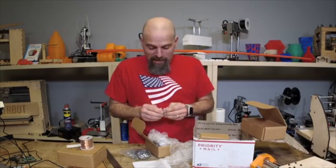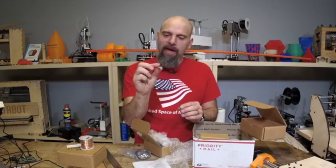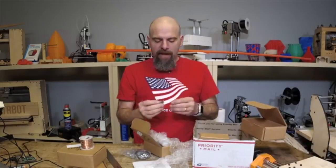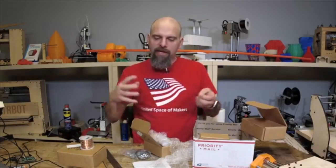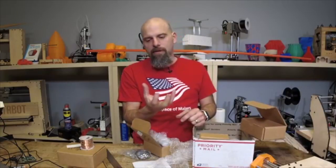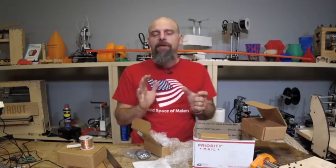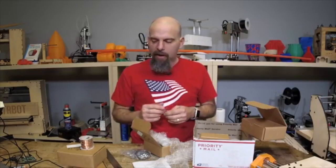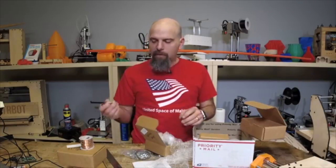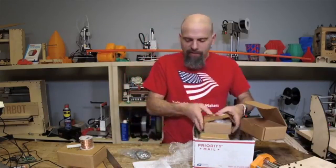These are strong. Anyway, so a Halbach array, it has a can for this motor, and you insert this magnet like that with the pole and directions going one way, and then you turn it. There's a certain pattern to this, and the lines of flux actually push against each other and bring it forward, so you don't have to have a steel or iron can behind it to stop the magnet lines of flux. So anyway, it becomes a very, very strong motor. It's called Halbach array, H-A-L-B-A-C-H. So you can make a really small motor that's really powerful. This motor I'm printing is going to be a 600 watt motor. So it'd be fun. All right, anyway, so that's a project I'm going to do.